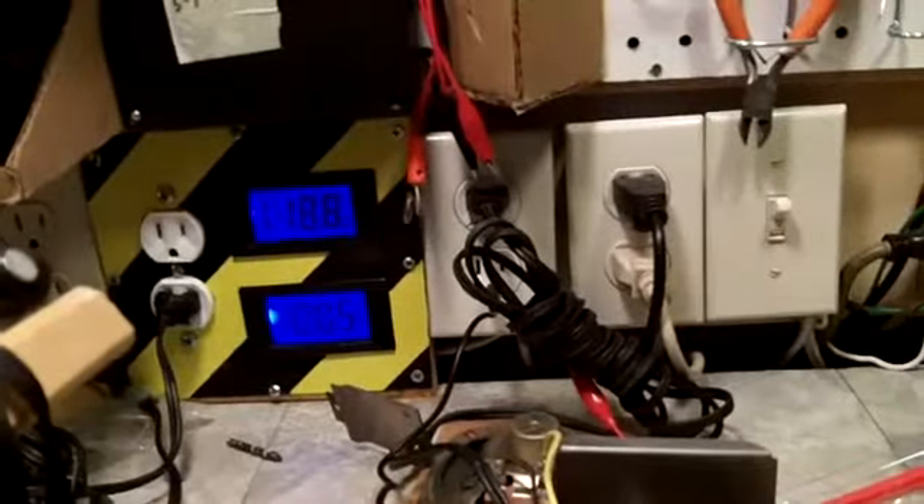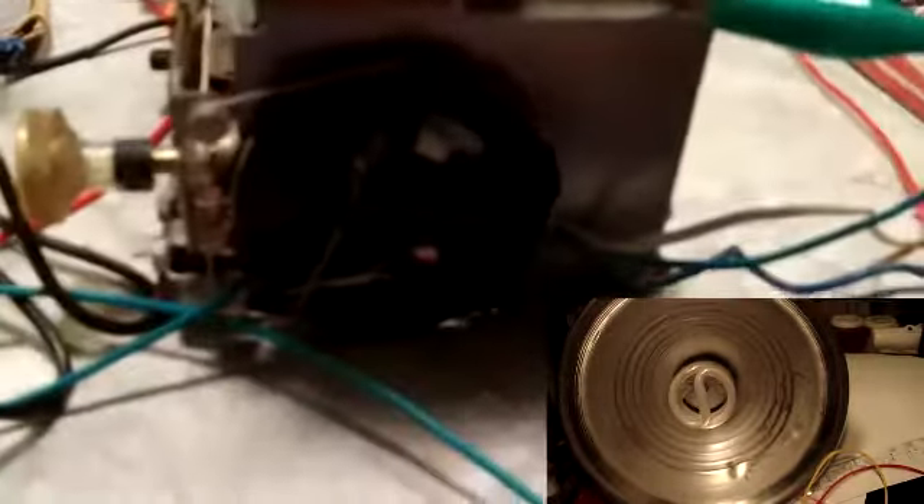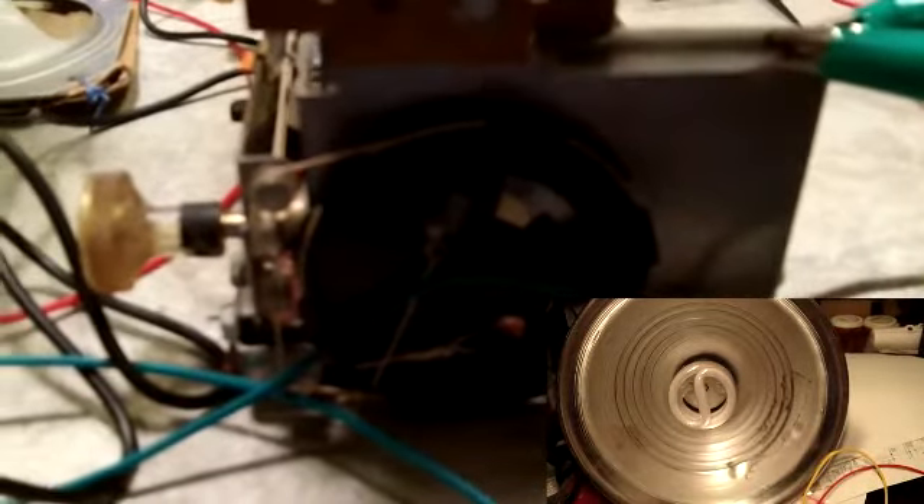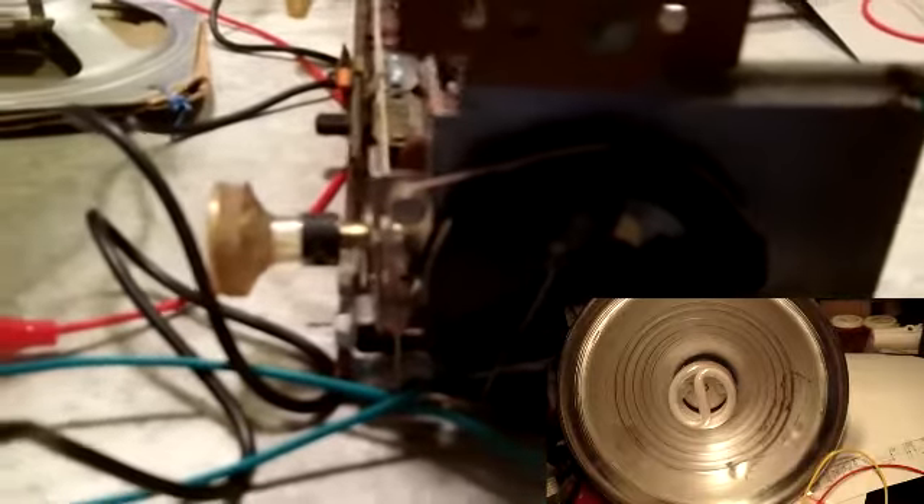The green wire is connected to the chassis of the radio that's powered by live line voltage, and the other end of it goes to the wire of the plug on the light. We see the light is not lit up — so we know that is safe because it can be touched, there's no problem with it. I believe the B plus would be the same way.